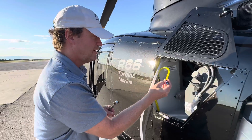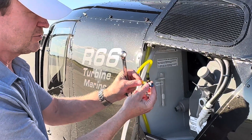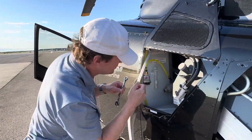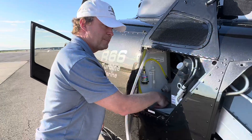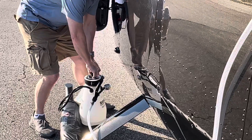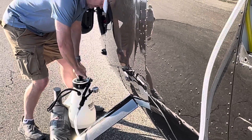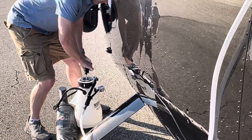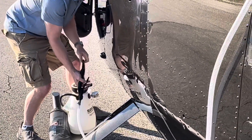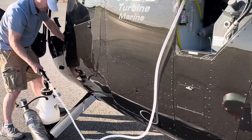Remove this part here and then have a similar fitting like this on the end of the distilled water pressure system. Remove this one with the 9/16, add the other one, just slightly snug it. Don't try to over tighten it or you'll loosen the securement bolt that's inside. Once you have that, pressurize the tank to 30-35 psi and then run it for 15 seconds at 8-10% on N1 until the water is drained out.